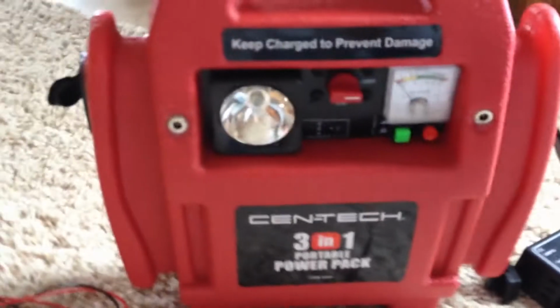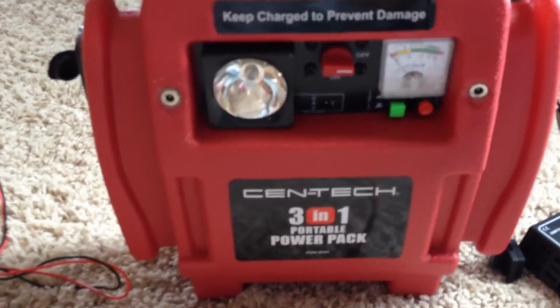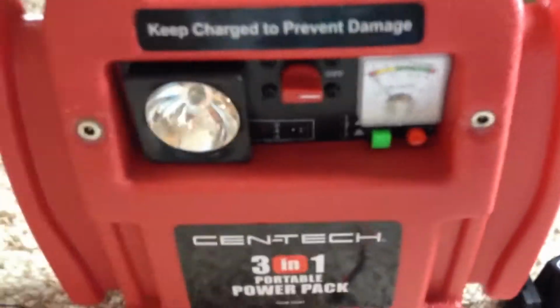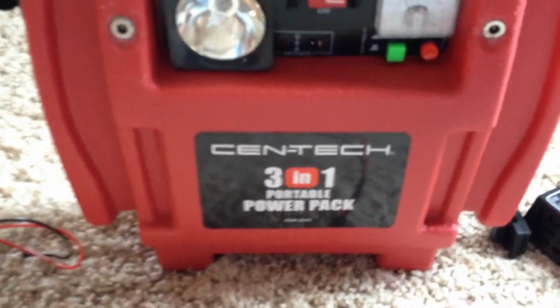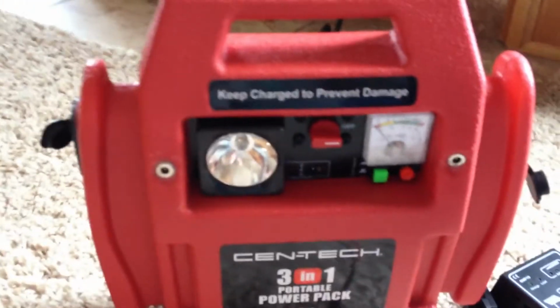If you had a 120 watt solar panel and hooked it into this, that would be 10 amps, you could charge this thing in like an hour and a half. It's always better to trickle charge with these small lead acid batteries. Your battery will last longer. So with this 1.19 amps, and that's in full sun, you could figure a half an amp per hour, as long as the sun's out, maybe 5 to 8 hours. So it'd take you a couple days with this 20 watt panel to fully charge this if it was totally discharged.